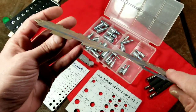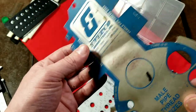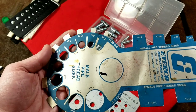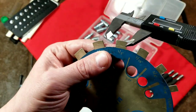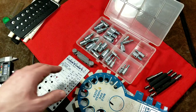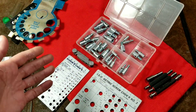Then we have an aluminum one — kind of a beat-up one I found at a thrift store, so I do need to bend this straight. But this is a pipe thread checker. We have male pipe thread sizes that you just pass into each of these holes to measure, and we have female sizes which are plugs that go straight into it. And then we have tubing diameter gauges that actually go inside the tube — calibrated so that this is a little bit narrower than a half inch. This says tube outer diameter; this little plug goes inside a tube which is indeed half inch in diameter. It also has a brass fittings gauge on the back and a sizing chart.